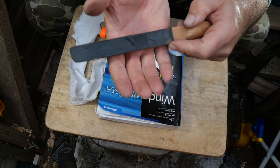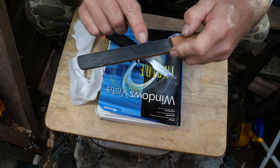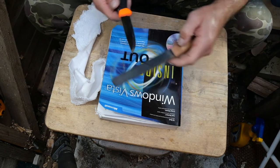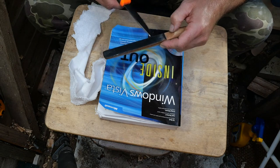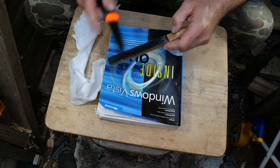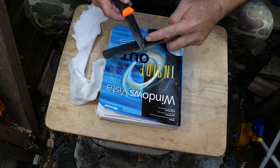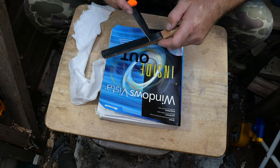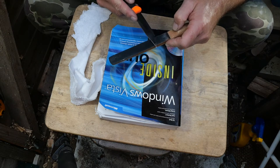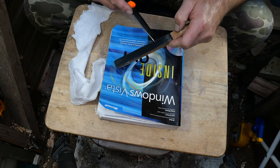Yeah, see — there are loads of little serrated marks there. If I was using a soft strop doing the strokes, the strop would spring up around the edge and I wouldn't have these serrations. But the trouble is you can wear your edge back very quickly that way. That's why I prefer to take control of everything and have a hard strop and do that process myself.